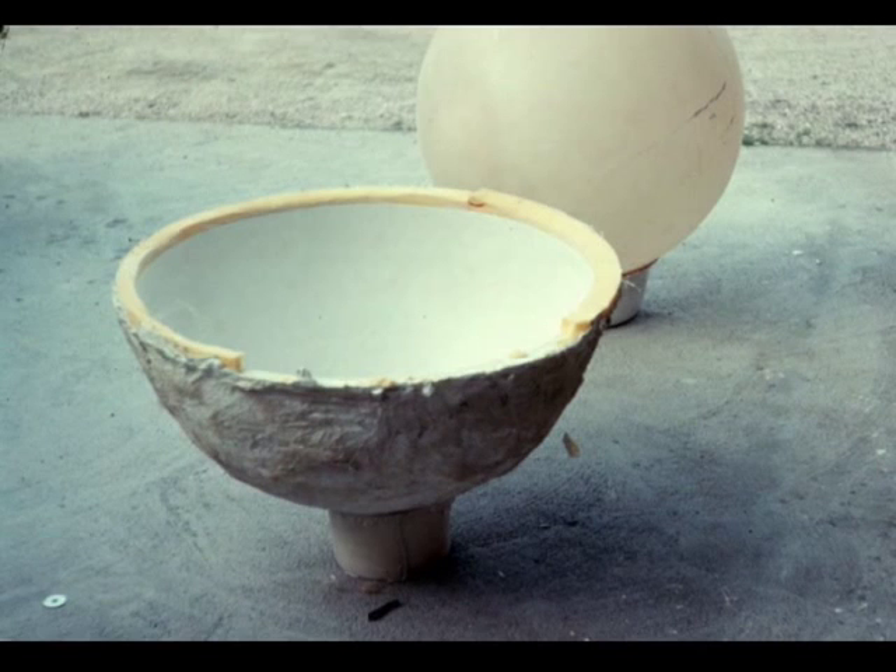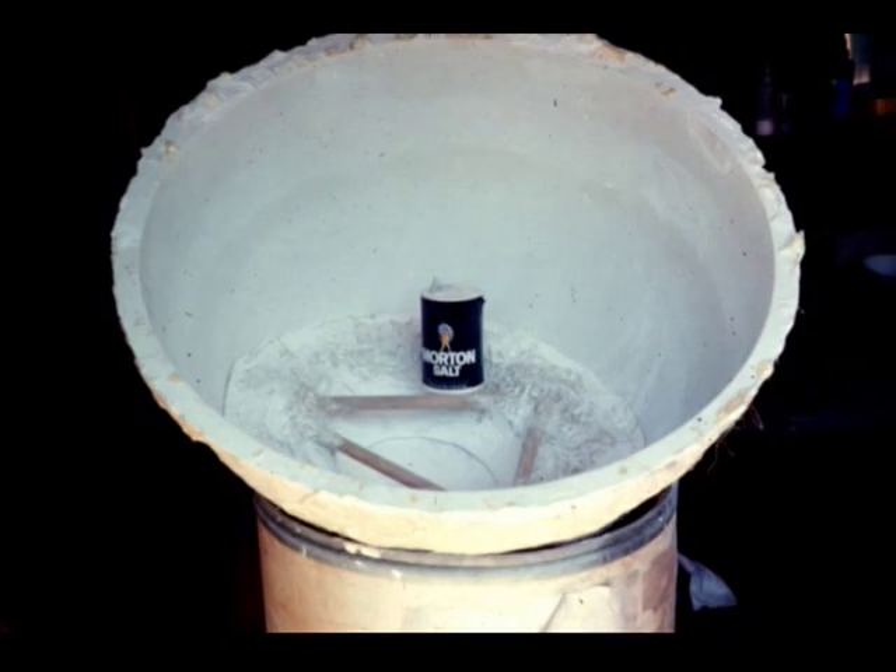The plaster cast is here shown removed from the sphere. I cast another smaller plaster, which you see on the inside, and then I used salt as an abrasive to start grinding the two the way you classically would grind a telescope mirror. I subsequently changed to sand, which was much faster, and roughed out a good hemisphere with all the high points in the surface being ground away smoothly.